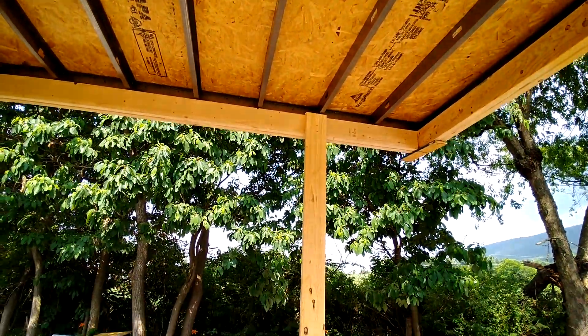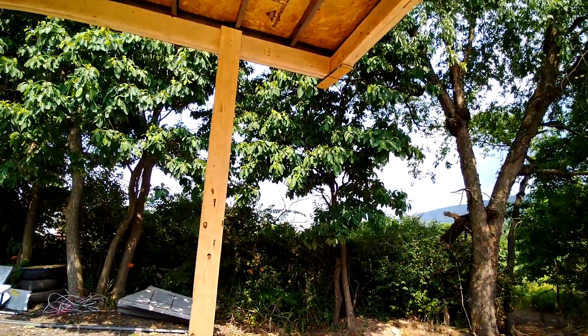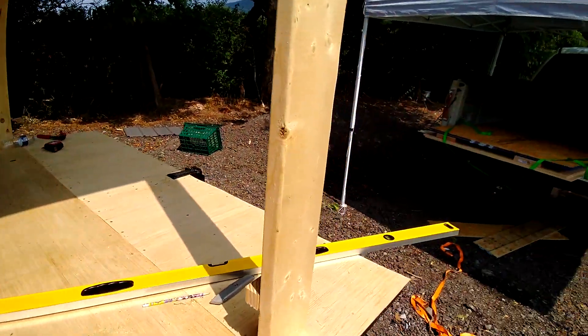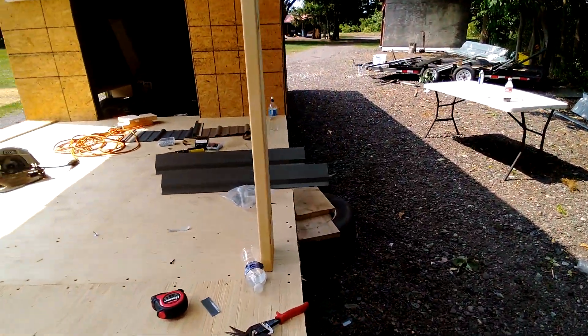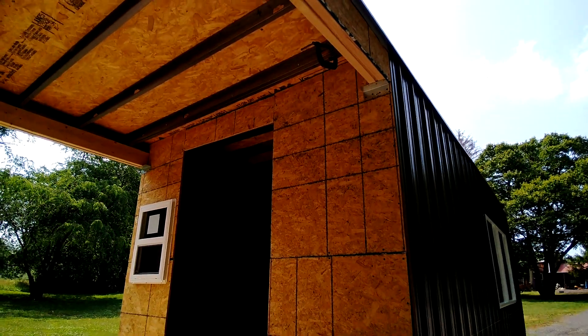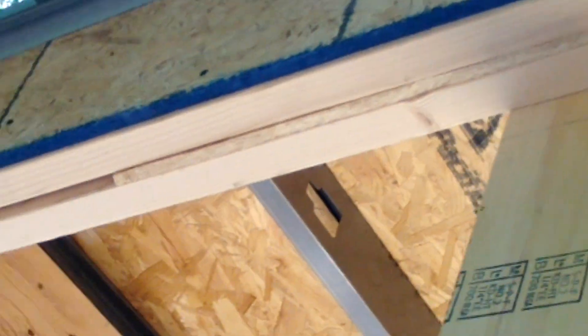I cut my stand boards down — they're just my drop leg to hold that until I get my post cut in there. I'm not going to put the post on until I cut the linoleum, simply for the fact that I want everything on top of the linoleum. I bulked that out on the edge with a piece of OSB as well, so we have about a four-inch beam now. That'll allow me to hook up my post topper on it.